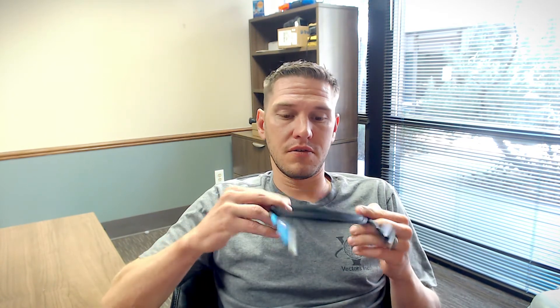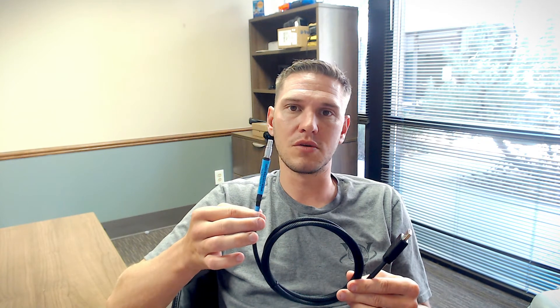It's important to cover which cables to use when doing this. All these are going to be updated through the Trimble Installation Manager, which we've done a couple of videos on as far as updating collectors - same kind of process. For most receivers out there, most will use a cable like this: USB on one end and 7-pin LEMO on the other. This goes into port one in the back of your receiver, and then we simply put a battery in it and open Trimble Installation Manager.